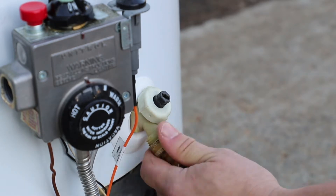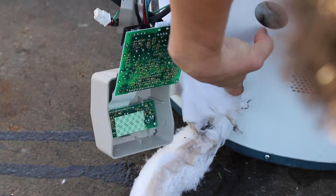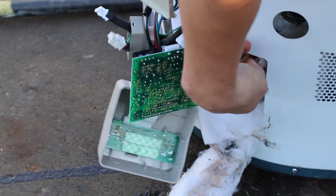Do the flush for about five to seven minutes. We also do a visual inspection — there's nothing you would do internally, you just look at the external and the insulation. There's a viewport you can look into to see if the insulation is wet, so we can look at things that are kind of hidden that you wouldn't normally notice.